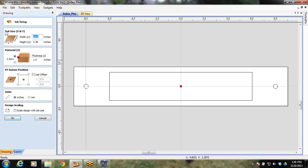So instead of having our 0, and this is where it's going to get a little bit tricky. We're recording this, so we can come back and watch it. You can pause it as you're trying it and going back and forth. Once I go through it once, we'll go back and slow down and go into it a little bit more. The way I tried this and got it to work was I put 0, 0 not at the bottom left corner of the part, but in the middle of the 2x4. As we watch these videos, you're going to see why this works. So it's 0, 0 in the middle on our 3D, it's 0, 0 in the middle of this, and we now have to 0, 0 it out on the machine.